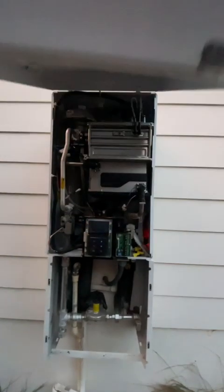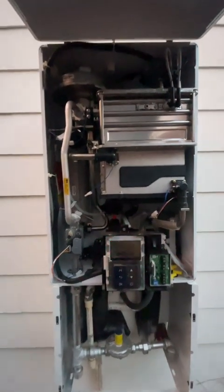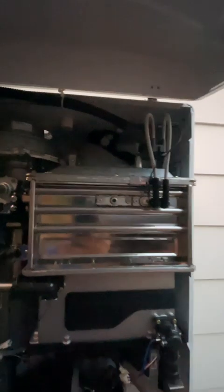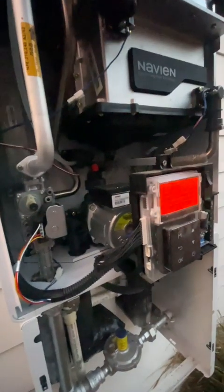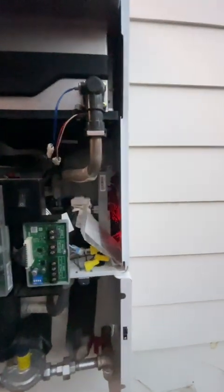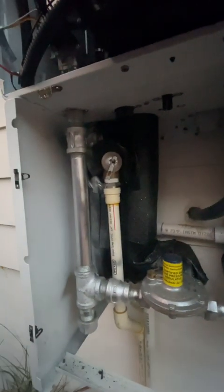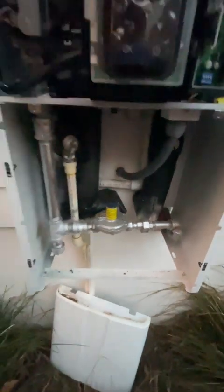It doesn't like it. It gives you an error code because you took off the hood. But they're the components. And basically the components are the heat exchanger, that shiny thing on the right. There's the exhaust for the appliance itself, double heat exchanger, some controls. There's a circulating pump right behind the controls. And I'm just looking for rust and corrosion and any signs of recent service. And this unit, just like all appliances this complicated, needs a good service and cleaning every year.